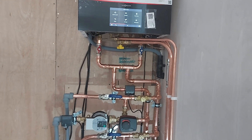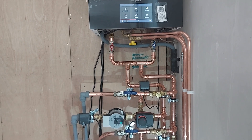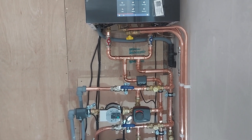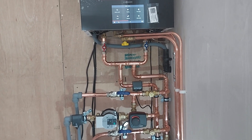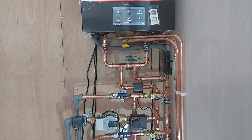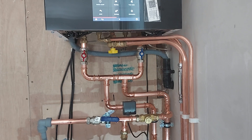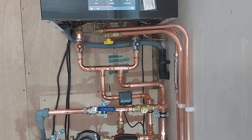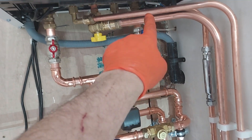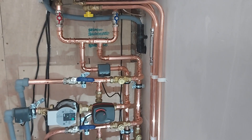I've done close couple T's quite a lot of times and found that if you don't follow exactly the rules on close couple T's they still work really well. You don't get absolutely perfect hydraulic separation, but we don't actually need it to be perfect — we just need it to hydraulically separate our system as much as we can. We've got our primary flow coming around and in effect the pump in the boiler is only seeing this circuit.